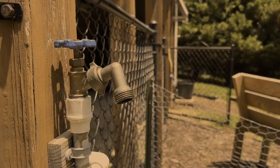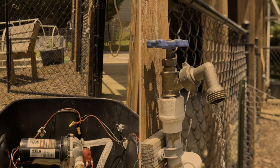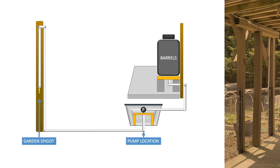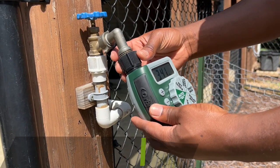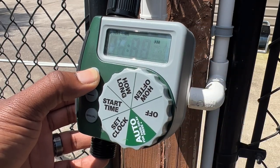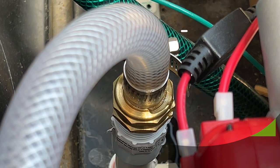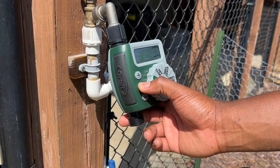I then opened my rain barrel's outflow ball valve to prepare to test the system. However, I soon realized that since my on-demand pump was a diaphragm pump, even though the pump was still powered off, it allowed water to easily pass through the pump straight to my garden spigot due to my rain barrels being installed at a higher elevation. To correct this problem, I would need to modify my PVC plumbing to my garden spigot to be higher than my rain barrels. Another cheap solution would be to install a basic hose watering timer which has a solenoid inside that blocks water from flowing to the garden until activated. I temporarily kept the watering timer connected and remotely turned on my pump to check for leaks. I noticed a leak at the end of my vinyl tubing outflow connection. Another tip: if the pump is cycling on and off within just a few seconds, that indicates a leak. Once the leak issues were fixed, I quickly tested the watering system using the watering timer.